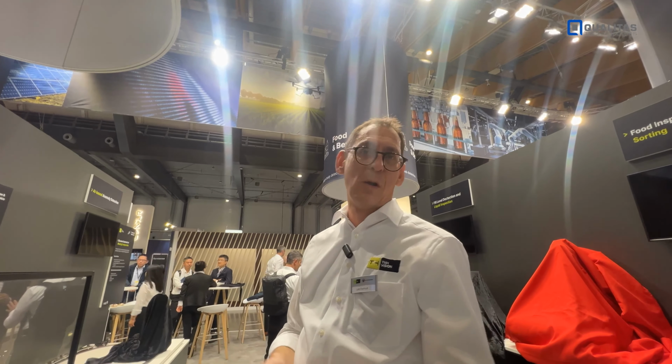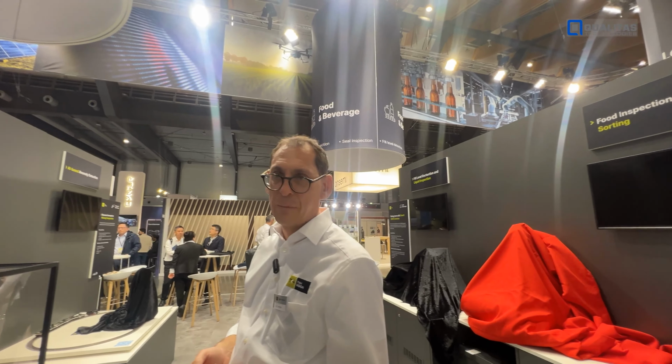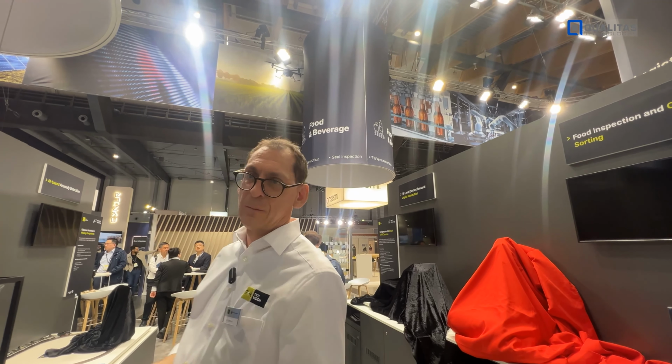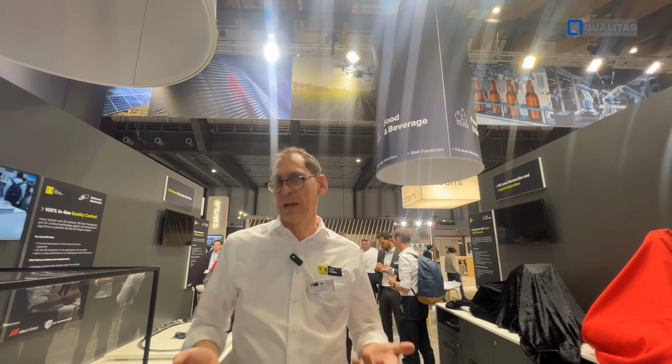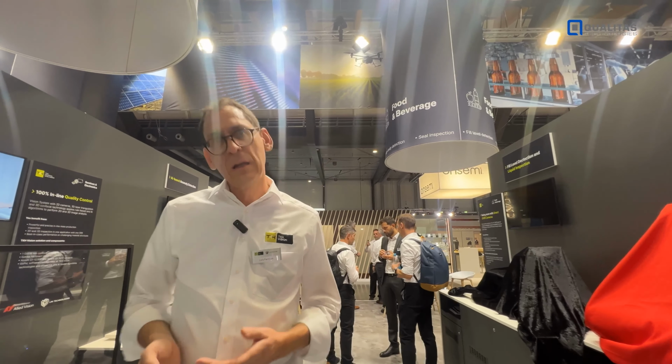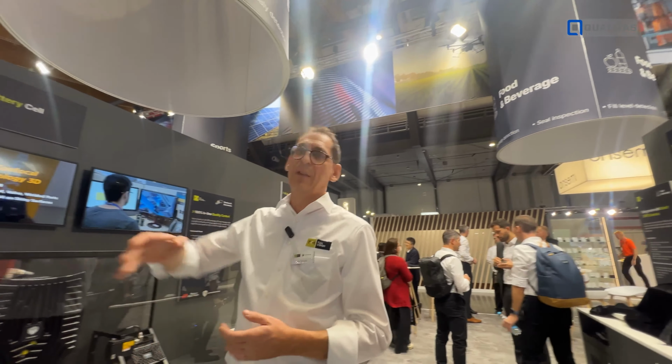And when you have, for example, a ball grid array in semiconductor, you have really heavily curved objects, ball bumps. Yeah. And this is something that can be fantastically detected. And with laser triangulation, if the angle is too strong, it just reflects away, it's getting dark. With the confocal scanner, you just will get it. High resolution and with also this acquisition.